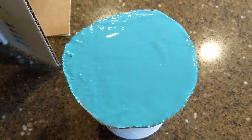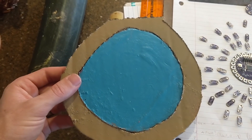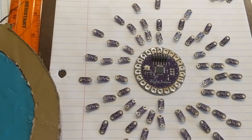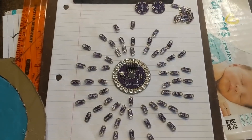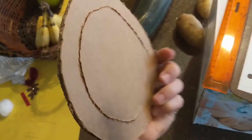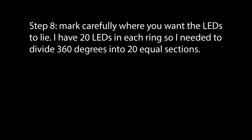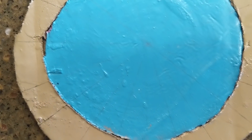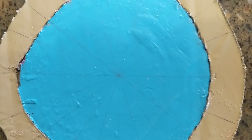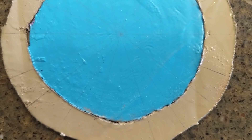I cut this part out of the Guardian piece because it would be too hard to mount everything while it's on the box. I decided to put the ring around the Guardian eye — the first two rings inside the blue area and the outer ring as the outer row of LEDs. I disconnected it so I can do all the soldering separately and attach it afterwards. I've marked 20 equal portions around it so I can place LEDs precisely, then I'll hot glue them down, drill holes, and start connecting the individual LEDs.